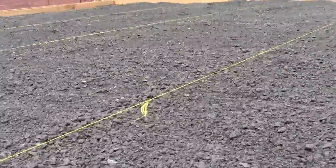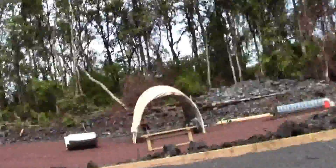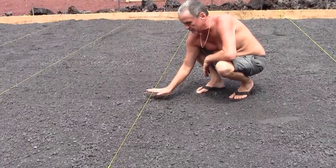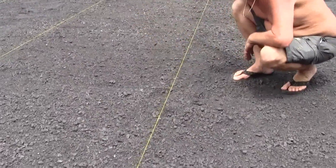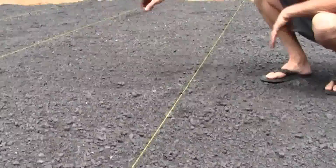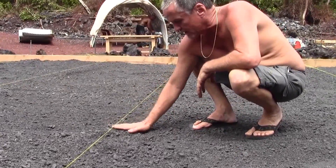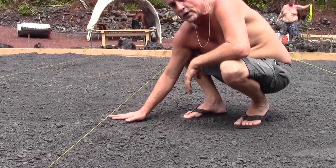See this right here — this is going to end up being four inches, this is going to be the slab. That's why all of these strings are put around here. After the plate compactor, you want at least four inches.